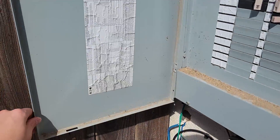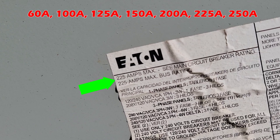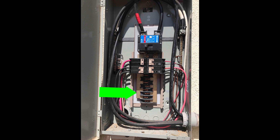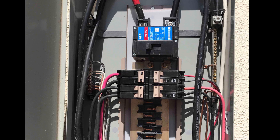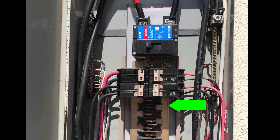There should be a current rating inside of the door. Common sizes are listed on your screen — mine is 225 amps. This tells you the maximum amount of current the internal bus bars are rated for. One bus bar is for line A (the red wires), and the second bus bar is for line B (the black wires). See how the bus bar alternates? In theory, all the wires connected to the right side should be black, and all the wires connected to the left bar should be red. This wire should be tagged red with red tape, like this one.